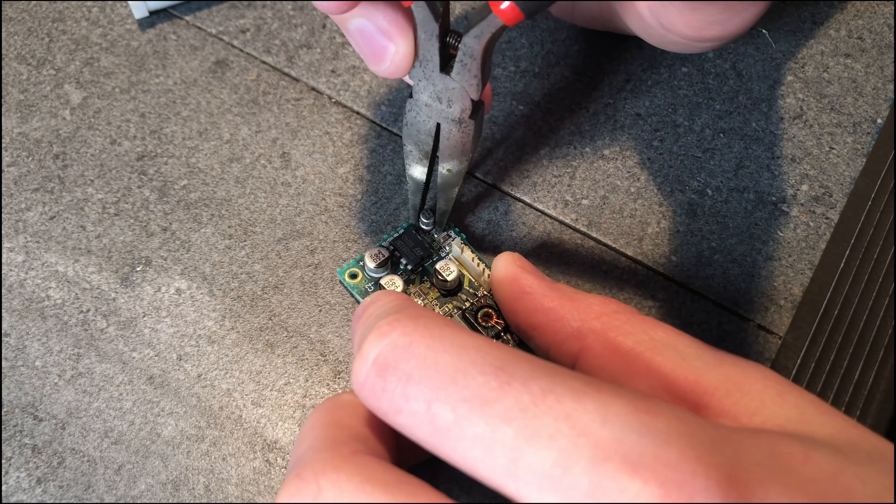Testing with just the batteries — we're not getting any audio. I should check that before I put it back together; I think one of those capacitors didn't get on right. I'll pop it back apart to get the audio working. As soon as I opened it up, I saw a capacitor rolling around. It turns out it was the one I had soldered to the VIA earlier — it got broken off. I'll use some magnet wire and solder directly to the VIA again, then stick it down there.